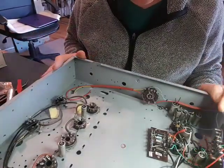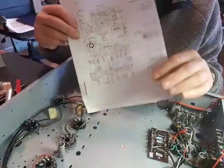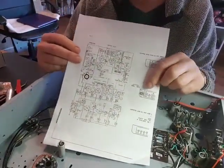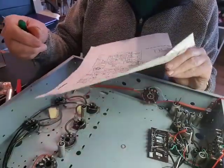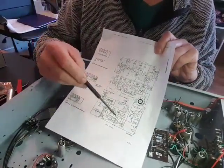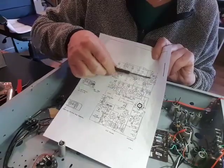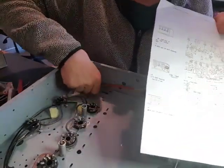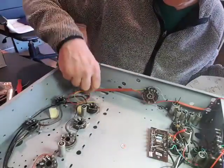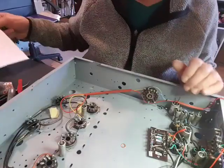That's the wiring I've been using for interlinking all the components. So that's how far I've got so far. I've been following this drawing I mentioned in the last video — it's out of the manual, it's an HT drawing. I've been marking off each wire I put in. I've only done the bottom half — the top half is all on this side — so I need to mount the other boards. These wires come from the mode switch to the other two boards.